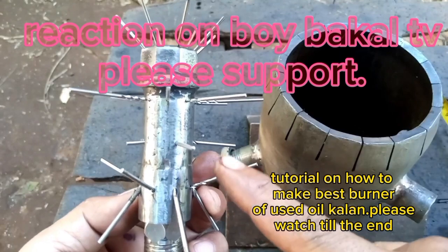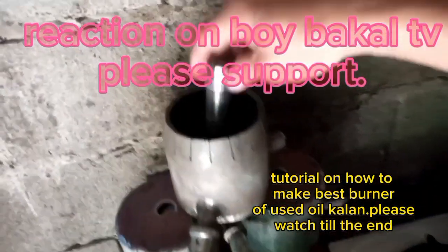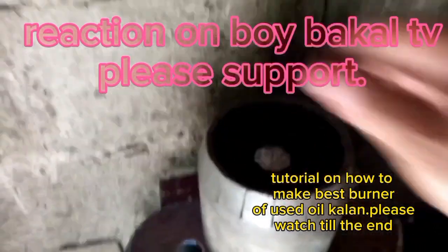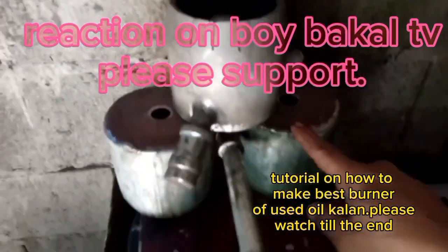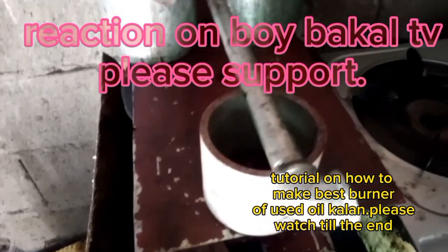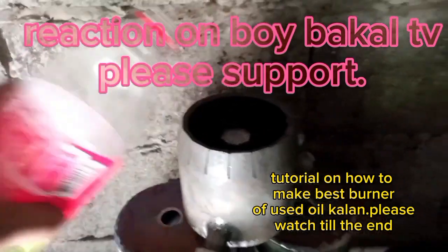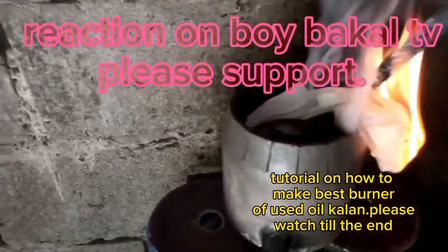Let's try this one and look at how the flame will perform at 28 holes. The connector in the base is one-half inch. We have two more units available not yet finished — we're going to test this one. Let's start a flame using diesel engine oil for faster pre-heat. Let's light this up by inserting tissue paper inside.